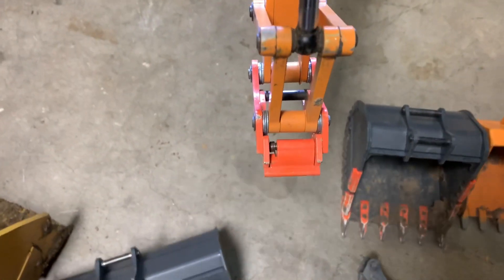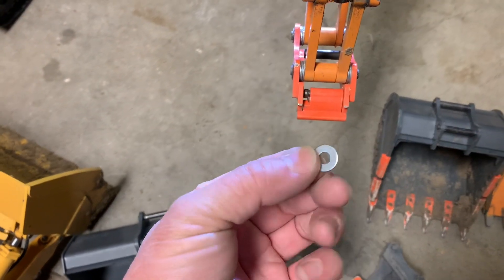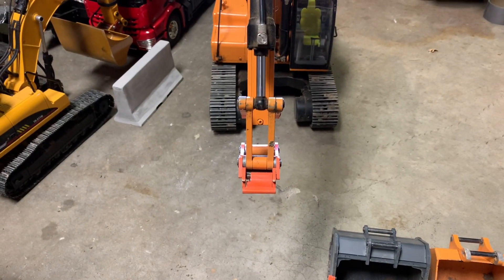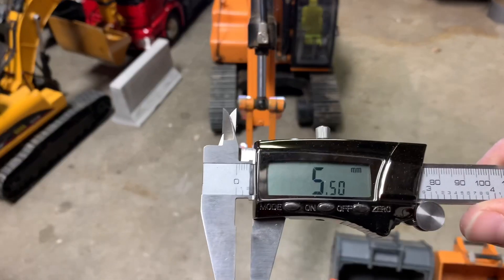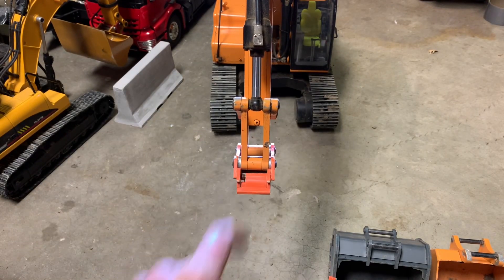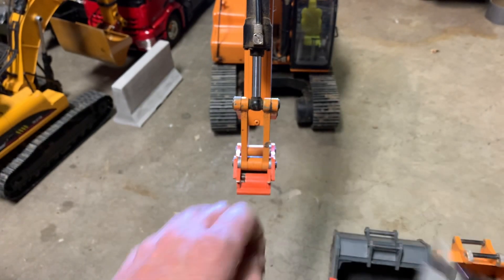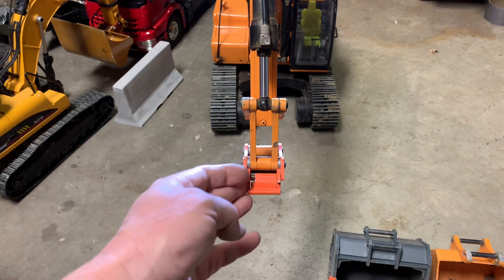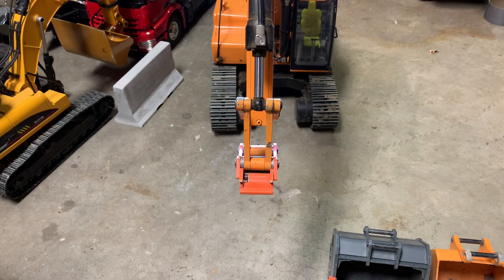What I've done is put some washers in there. I had to drill out the hole to six millimeter to fit that six millimeter pin, because the hole on these washers was just shy. I had to drill it out to six millimeter to get the pin to go through. The thickness of these washers was one millimeter, and I had five millimeters to make up from 25 to 30, so I used five of them. It's slightly off center — I did two on one side and three on the other — and I haven't had a lick of problems with it. That's been working great.